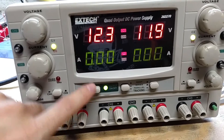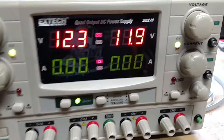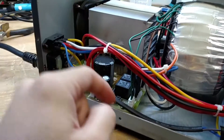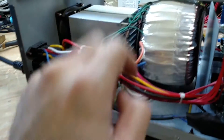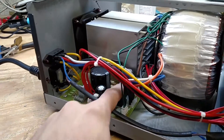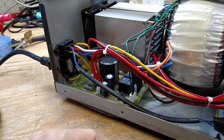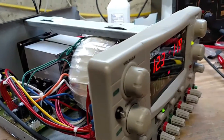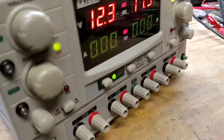I did some reverse engineering and I thought maybe I can figure out if I can get this to come up with the output off, but it turns out that this little switch here is actually controlling the relays. There are four relays — two on this side and two on the other side — and they actually control the taps on the AC side going into the bridge rectifier and then to the pass transistors. Unfortunately, they're switching the AC power, essentially killing power to the whole thing with that button, so it's not going to be easy to make it show the voltages before you hook up.